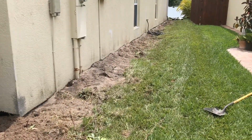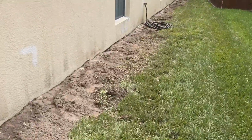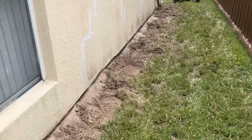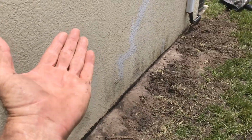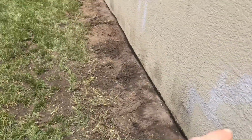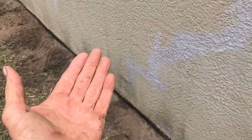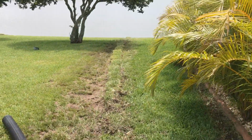So we're pretty much done. We've got it all backfilled. You can see it back over here as well in the front bed. We'll just walk around. Remember why this was done, because footer pipe protects the floor and your foundation. Water had been coming up underground, moving under and coming up inside the home, causing all kinds of problems inside there. So we've got, people call it a French drain, but we've got gravel perforated pipe that sits down at the footer level, way below the floor. That collects subsurface water. We pick it up, we change to solid pipe, we discharge out and over the hill.